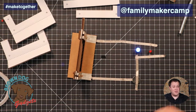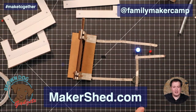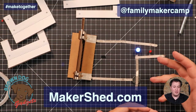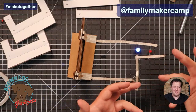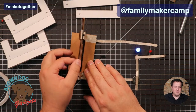Ours and the ones at Maker Shed, their paper circuit kits, do have built-in resistors in them, which makes life easier. But 3 to 4 LEDs per coin cell tends to be a max you'd want to do. I usually try to do no more than 2 in my papercraft projects. If you really wanted to, you could also use a 2 AA or 2 AAA battery holder to add a lot more LEDs. But anyway, that's knife switching here. Switches are fun.